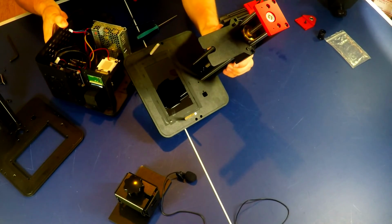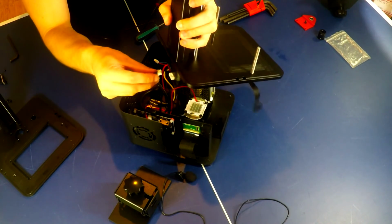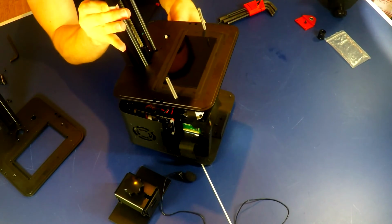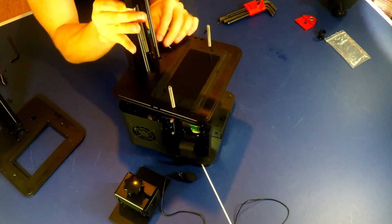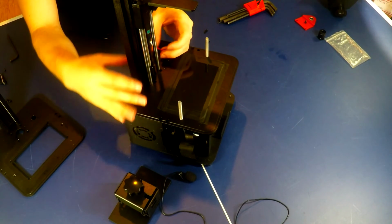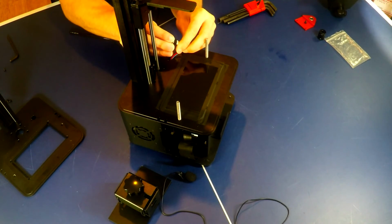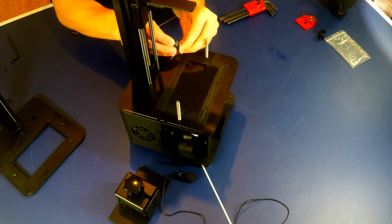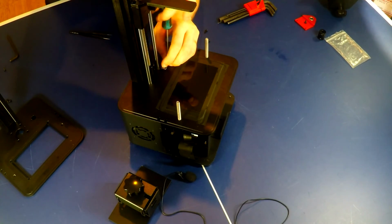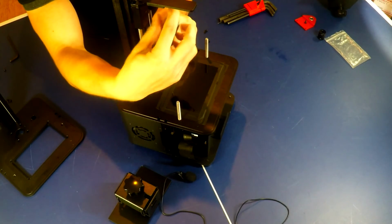All of the new parts are completely fitted, so it's time to put everything completely back together. We're going to plug in the stepper motor, making sure that we align the pins, and then we're going to carefully lower down the top assembly, pulling through the limit switch wiring from below. We'll plug back in the limit switch and then there are 2 screws that hold it together. Those annoying little black washers need to be checked to make sure that they're in place, otherwise when we screw it down we'll crush the electrical connectors to the top of the printer.